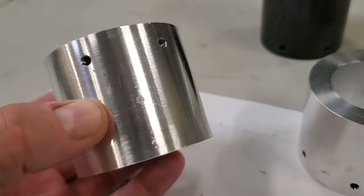This is the bottom aluminum part that attaches the azimuth axis to the bottom of the mount. And here's the harmonic drive. Look at those, don't those look cool and high tech? The harmonic drive goes on, and then there's a little access hole in the flange to fasten the set screw that holds the stepper motor shaft to the harmonic drive. And then we get 6 more M4 screws to hold the harmonic drive to the 3D printed flange.